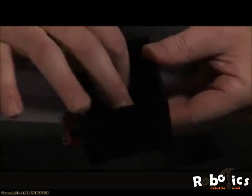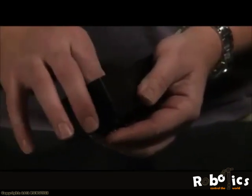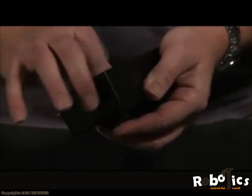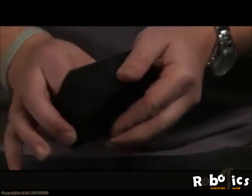Now, the reason we do this is so that when we're doing the soldering, we can do the soldering out in the open rather than trying to work down inside our enclosure. Later, when we're all done, we'll take them all apart and put them out the proper ways. On the red switches, make sure they're both facing the same way with the writing on the switch. That will help when we do our soldering later.